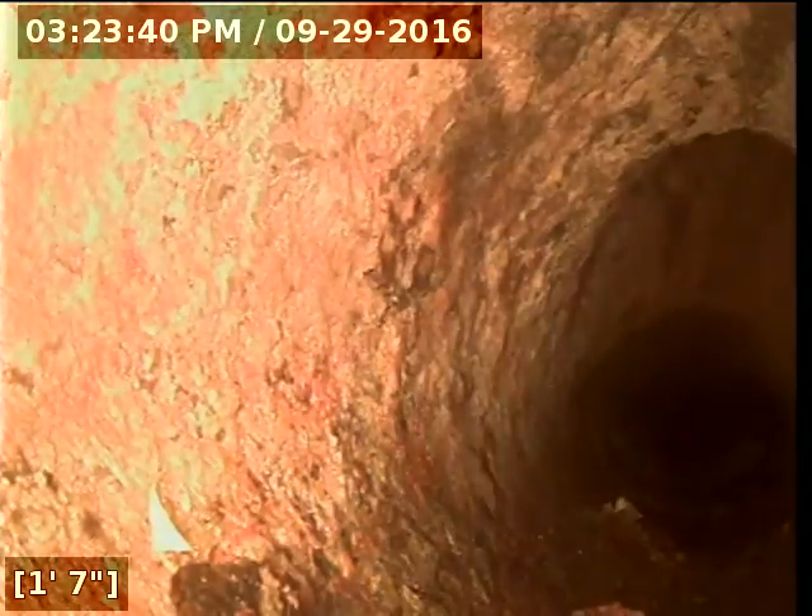The line is going to actually reduce right about here. We're going to go ahead and end the video — pull back and show it to you one more time. That's the cast iron Y right there. There's actually a hard 90 bend there coming out. We've got another two-inch tie-in right there on my left wall. We're in cast iron. We cabled it, but that root's actually sitting at the bottom of the pipe — we got very little of that root cut out, as much as we could. Then we come into a little piece of ABS, which is actually coming off that clean-out, and it looks like there's another 90 bend going in from that ABS. And then we're coming back out the clean-out.